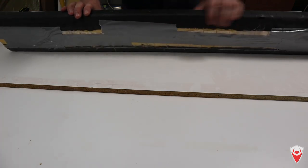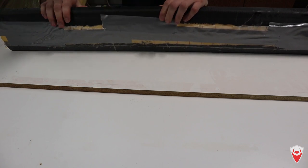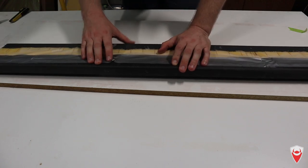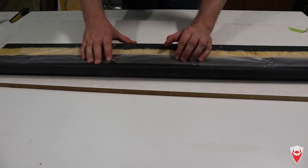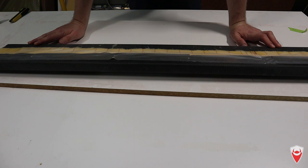The layup didn't really conform as well as I wanted to over the spar. I expected it to drape a lot better, possibly because I'm just expecting it to have bigger radiuses and would drape without any assistance. So I had to massage it in a whole heap, and then I thought that I'd be going and putting it in a vacuum bag, but realised that the whole point of this was I'm meant to be doing this activity with no tools, no vacuum bags, nothing special.